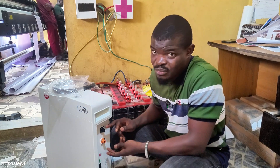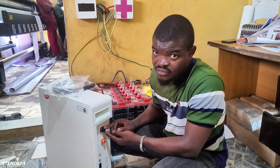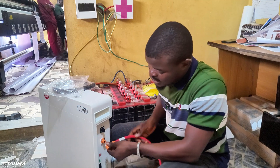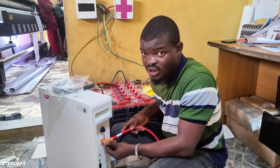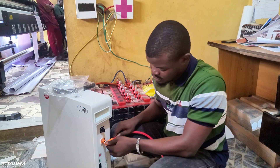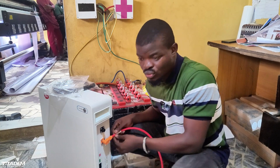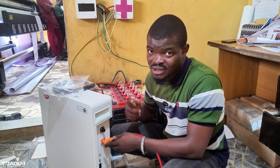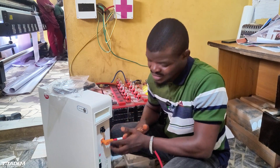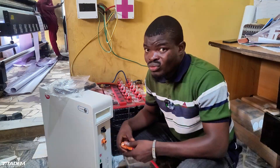But with this design, I can't do that. They're not giving me room for it. I'm not disputing the connector type, but at least they should have made it two terminals each — two positives and two negatives. That way I could run a cable from one battery to the next. Right now I can't connect two cables to one terminal, so I'd have to run everything through the busbar. With 16 batteries, that means 32 cables going to the busbar, which is unnecessarily bulky.